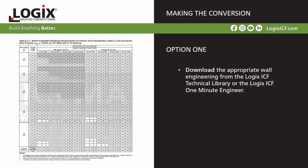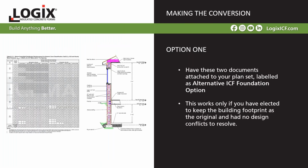And then secondly, download the appropriate wall engineering table from the Logix ICF technical library or from our app, the 1 Minute Engineer. So with those two documents, attach them to your plan set and label it as an alternative ICF foundation option. This only works though if you have elected to keep the building footprint as the original and had no design conflicts to resolve, or very little. So this is the easiest option.